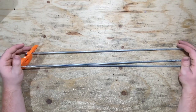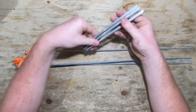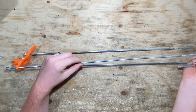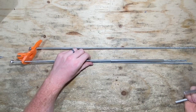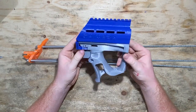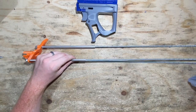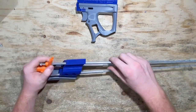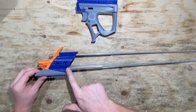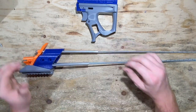The blaster is now starting to take up a lot of room, so I'm sorry if things drift out of frame — I'll try my best to keep things in place. Now we're going to take our spacer tubing — this is aluminum spacer tubing, highly recommend it, I'll talk more about it later — and slide one over each of these threaded rods. Then we're going to take our pump grip and slide it on next. We've got the pump grip in there, and I'm double-checking that these spacer tubings are in their grooves — their circular grooves — from earlier.